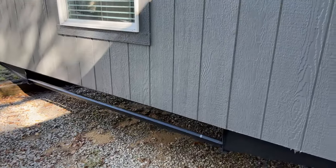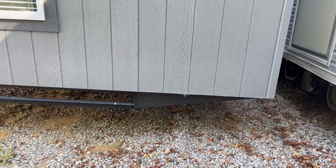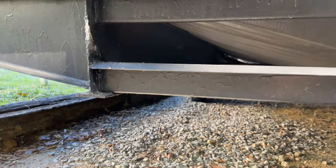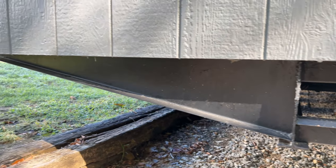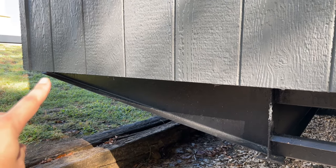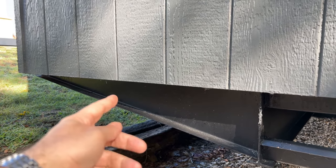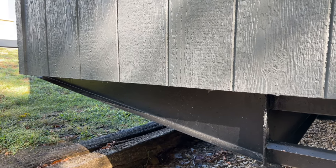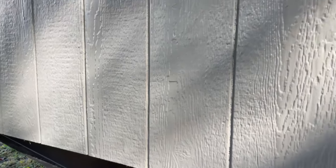As we come around the backside, it's going to expose this outrigger. This outrigger is what holds up your sidewall — it's welded to your mainframe, which holds up the house, and it also extends all the way to the sidewall. So full-length outrigger — this is going to hold the whole weight of the wall over here on the edge versus coming halfway, which puts a lot of sag on some other manufactured homes. On this one, it's going to last over time.